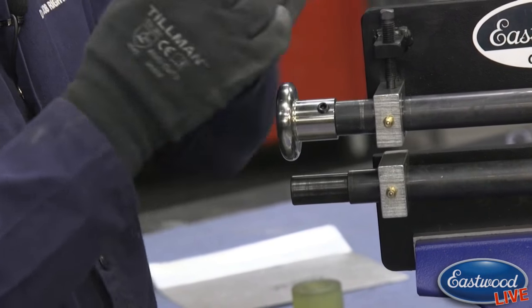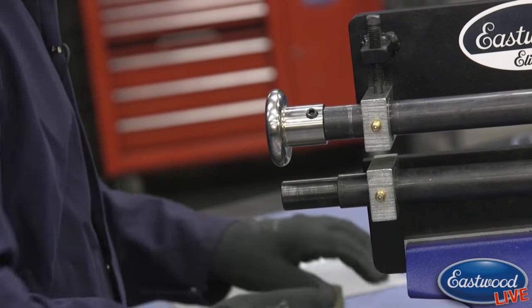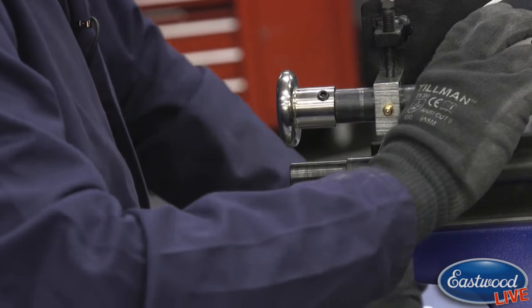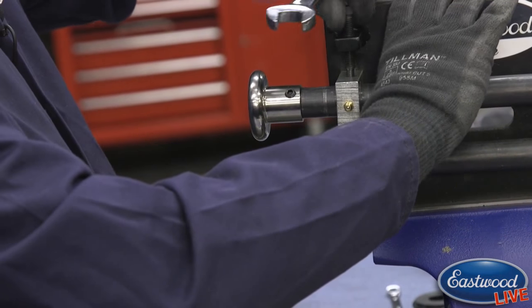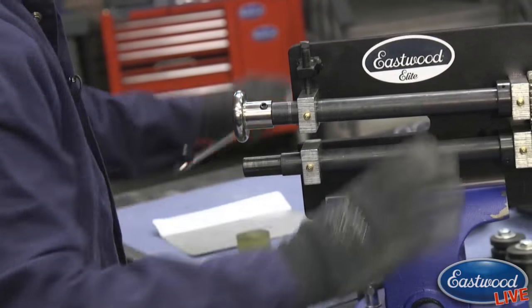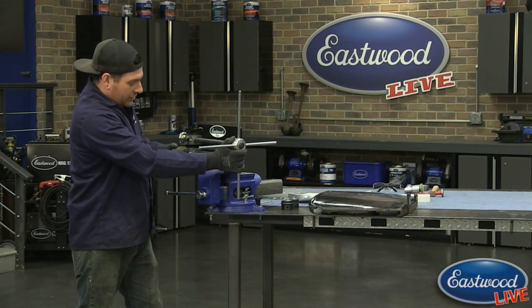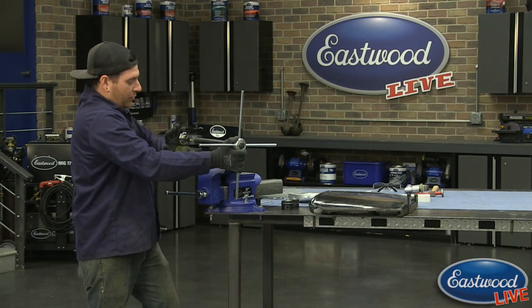If you're doing a small panel and you are by yourself, if you try and use one of our larger throat bead rollers, you just can't reach the handle to get it to actually do what you want. So it's better to have a smaller bead roller like this because you have the control for doing some of this edge work, or something that's not in quite as big of a panel. Most of the work I do with a bead roller is edge work. So it's kind of perfect because a lot of times I don't really need the throat of a larger bead roller.